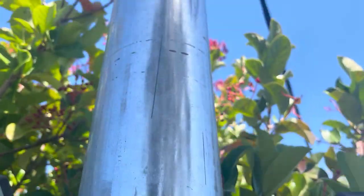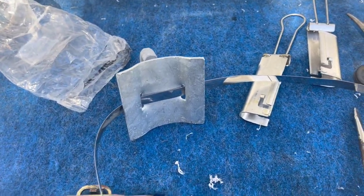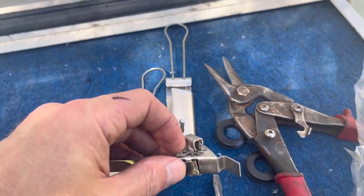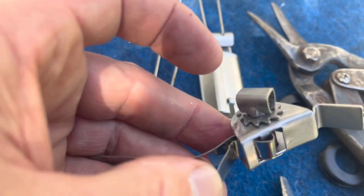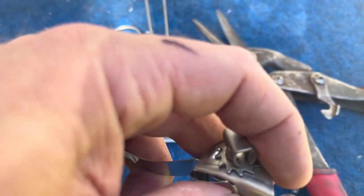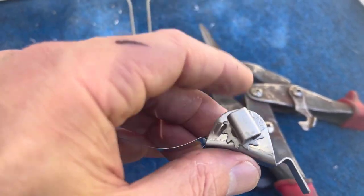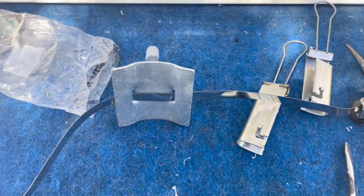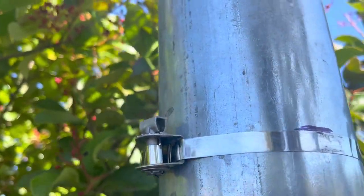There's my mark — 600mm below the power line — that's where we'll put our hook. I thread my strap through the hook and put the end on in preparation. It just feeds in through the back, comes out this first slot, then you feed it back in on the second slot. I like to bend that around as an added precaution. This part goes into the pole and this part sits outside. Then you've got your ratchet — just stick a screwdriver in and ratchet it up. I like to get it all prepared before I go up the pole.